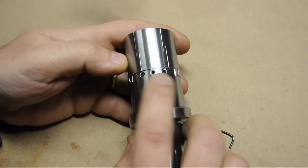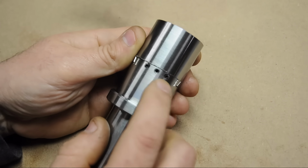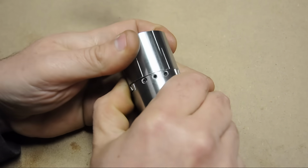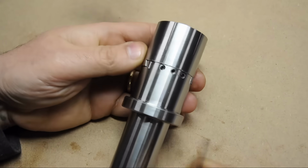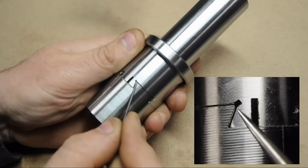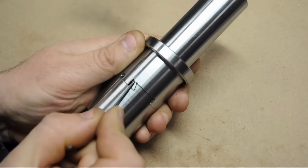I was a little concerned about the size of the M3 screws, but they're doing an excellent job of locking this head down. I've set them in firmly, not excessive, and the head just isn't budging. I'm really happy with that lock. Though to get that feel just right, I did come in and cut a little bit more of a relief on the inside of that dovetail. I undercut about another 60 thou, a millimeter and a half approximately. I just thinned up that little area there.